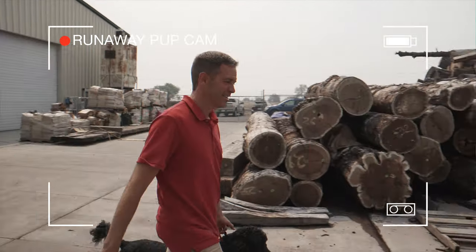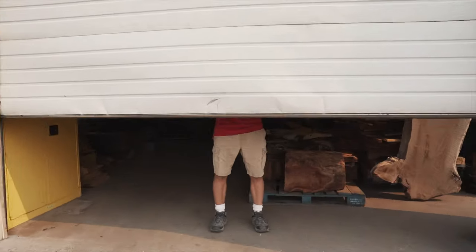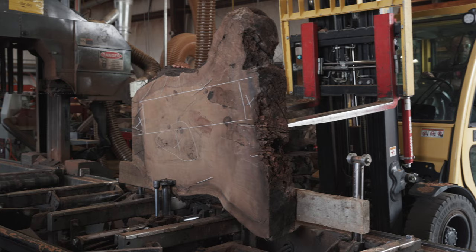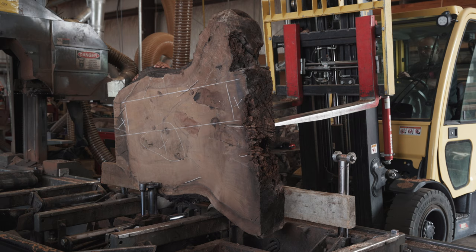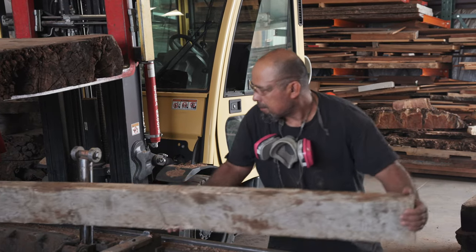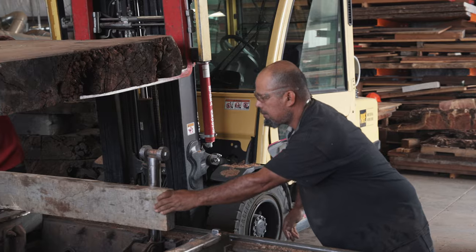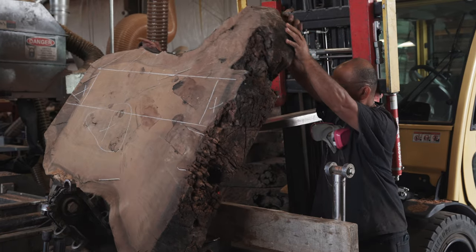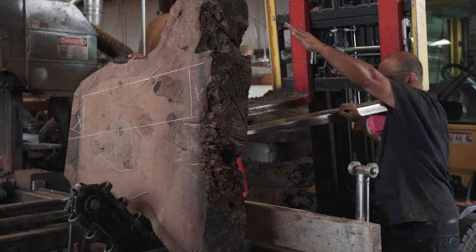The talent ran away chasing woodchucks. We've got one of the caps in off of Slabzilla. We rotated it up so it's going to be easier to cut. If you notice, we've got a full dimension two by six that we cut here. These are our dogs for clamping normal eight to ten or longer logs in here. But because this is short, it doesn't fit into the normal clamp on the sawmill, so we had to get creative. This was the simplest way to do it — also the cheapest.